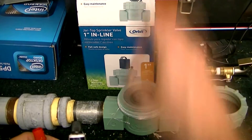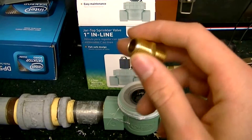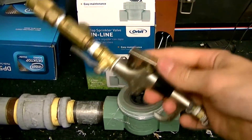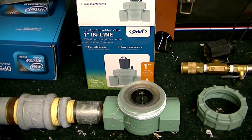What you'll need for this is the sprinkler valve, epoxy — I'm using JB Weld — a male 1/4 inch thread piece, and then a blow valve. You really just need a blow valve. With that, you'll be able to make a trigger system for a pneumatic air cannon.